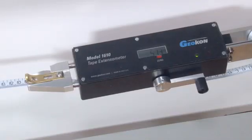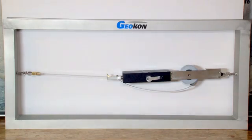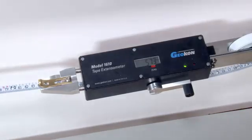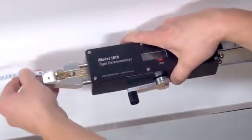When you are satisfied the tape has been properly tensioned, take a reading on the digital gauge. Twisting the unit to see the gauge has no effect on the readout as long as the tensioning handle is not moved. The total distance between the eye bolts used equals the sum of the distance along the tape as shown by the punched hole used, plus the digital gauge reading, plus any corrections that must be made to compensate for temperature variations. After taking a reading, turn the tensioning handle anti-clockwise until the sliding bars are extended enough to remove the locating pin from the tape.